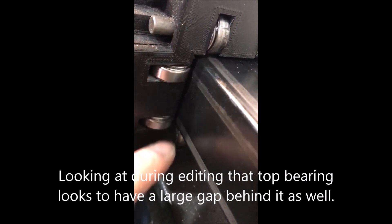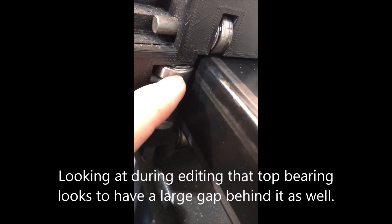I wiped this bar down because it sounded like it was grinding across this bar a little bit. I checked my belt in the back and the belt looks pretty good - not perfect but pretty good. But I did notice when I was reaching back in here, this pin has dropped way down. That pin should not be sticking out more than a quarter inch, like this pin - maybe half inch. That's the pin these two bearings ride on.